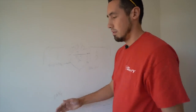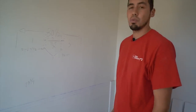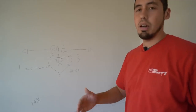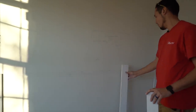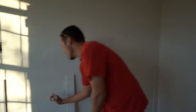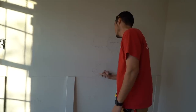We're comparing 24 and a half to 28 and three quarters — I think we're justified in putting two vertical stiles here to split this into three panels. Your eye will not pick up that difference between walls, and your eye doesn't even want to. It looks at it as a whole and says 'yeah, that looks right.' If it was way off, your eye would think something was wrong. The human eye needs to be tricked, and this is a perfect example of that. Panels will never be the same size on every wall unless you have a perfectly square room.